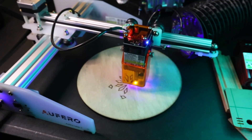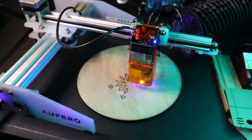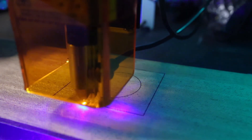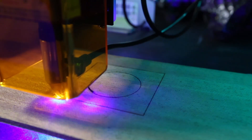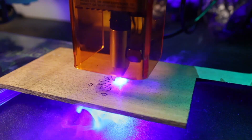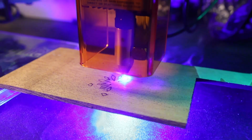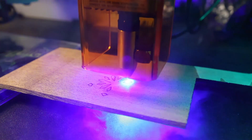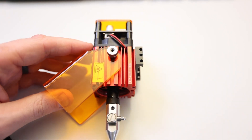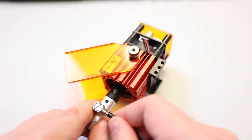Third is the LU-2-4 Long Focus, or LF for short, and it does what it sounds like — it's got a much deeper depth of field, which makes it ideal for cutting applications. This module has a 0.17mm by 0.25mm dot size, nearing twice that of the SF module, so you lose some of the spot size benefit compared to something like a CO2 laser. But it pumps out the same 4.5 to 5.5 watts of power with a longer throw, making it much easier to get through material while cutting. This is also the only module that has additional air assist functionality, which provides a massive amount of value by reducing flare-ups and keeping soot and smoke off the lens.